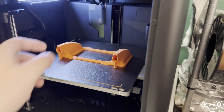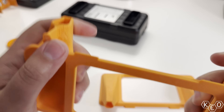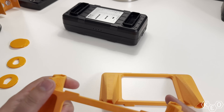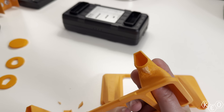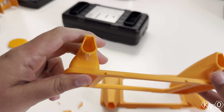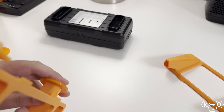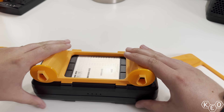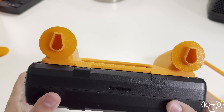This kind of has some steep overhangs, so it would be a good torture test. If this could be printed out of ABS-GF, I'm sure PETG, ASA, or ABS would probably print just fine as well, even though the overhangs are a little treacherous. The model did print pretty well — the surface finish was reasonable, the overhangs were reasonable, everything went pretty decent overall, seven and a half out of ten probably. The design support I made needed a little bit of revision, but this was enough of a success to move forward.